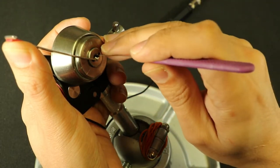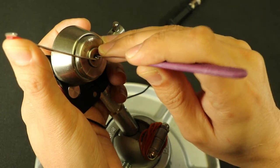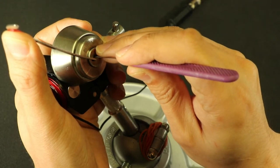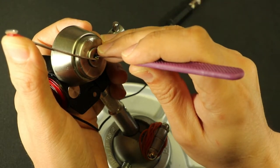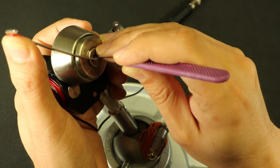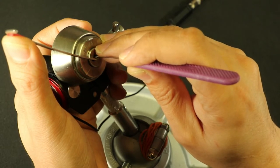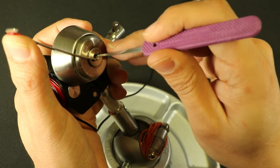This one does have some mastering on it, and some of the mastering is a wide true gate — we'll see that after. It results in large jiggle when it's set. The one behind it is still loose. Let's go look at the right side again. A lot of times I know the second wafer on the right likes to drop. The second wafer on the right indeed did drop — but wait, I hadn't set it yet. So the second wafer on the right is jiggling now. I just tested all three on the right — they're all jiggling.